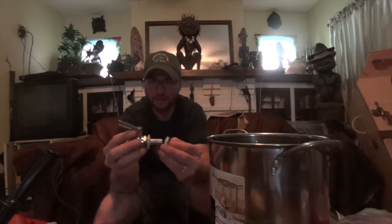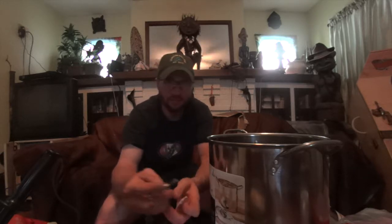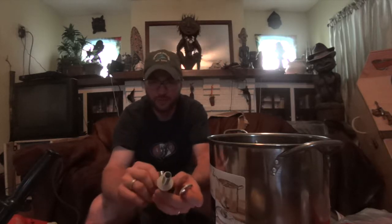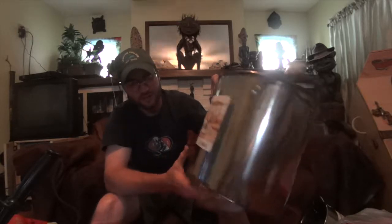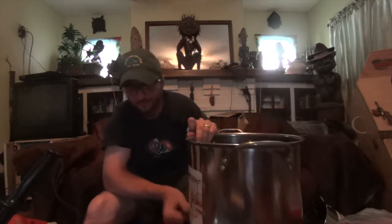So utilizing these, your gaskets are going to go in between here. I'm going to use the nut to sandwich on. So all I did was take, again, if I'm super simplifying this, it is not because I'm assuming you don't know what you're doing. It's because somebody may not. So all I did was put on a rubber gasket with the fancy silver gasket cover. Now, that edge is deburred, and that's another beauty of a step bit. No need to file.